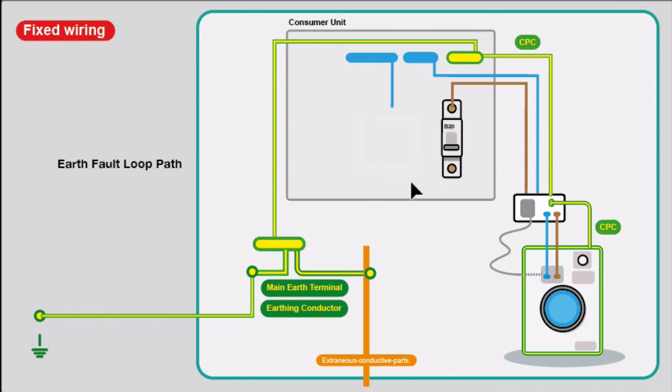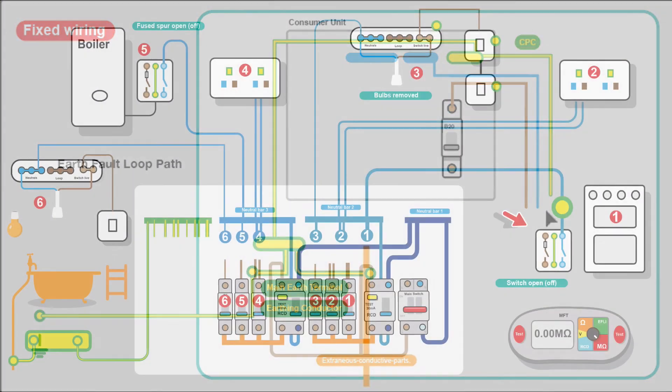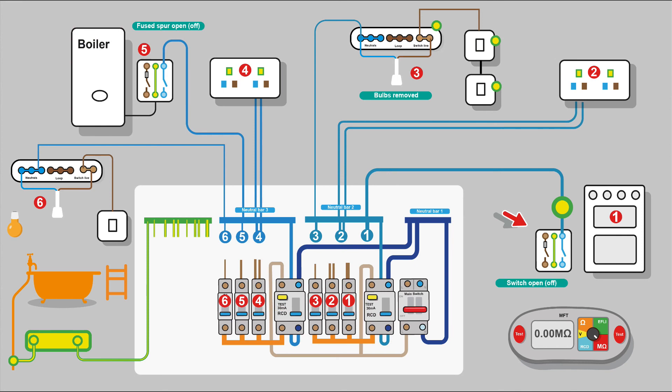We don't want any electronic devices in the fuse board like the RCD interfering with the test — we can't physically remove them but we can disconnect them. We don't want any loads, no neon sockets, no USB sockets, nothing like that. All we want to be testing are the cables. To clarify: we don't physically remove main switches and RCDs — we switch off these devices to achieve isolation. Thanks for watching part two; part three is about the actual testing and issues that can arise during testing.